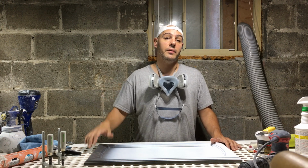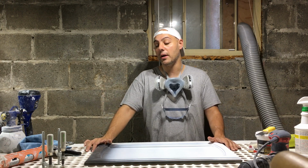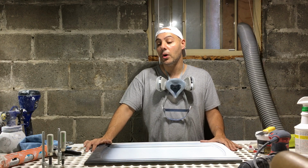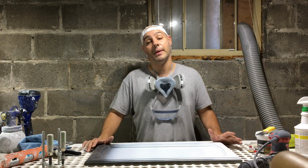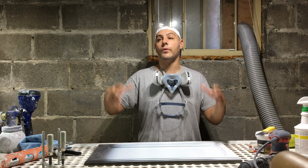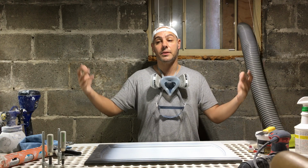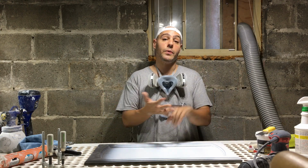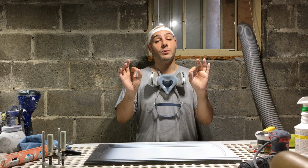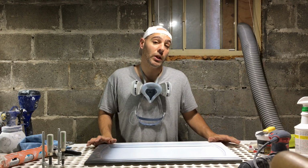Myself and the guys who work for me, my workers, are all trained by me. So we all know how to apply a really good finish, sand between coats, and do it by hand. The reason for that is I really don't like spraying in people's home. It just causes a lot of overspray and a lot of dust and a lot of mess. So we try to keep that down by wet sanding and doing the on-site work by hand. It absolutely matches the finish on the doors, and you will love it.